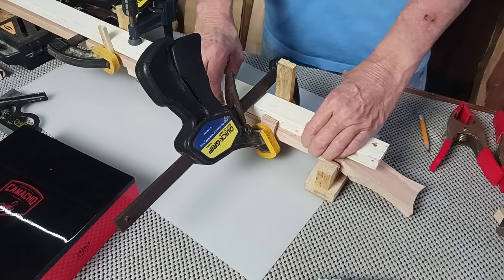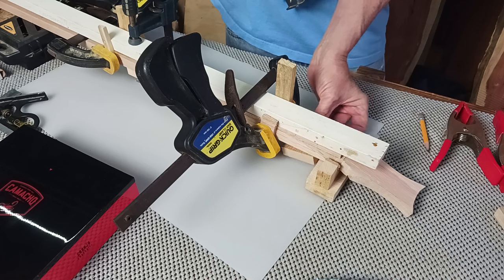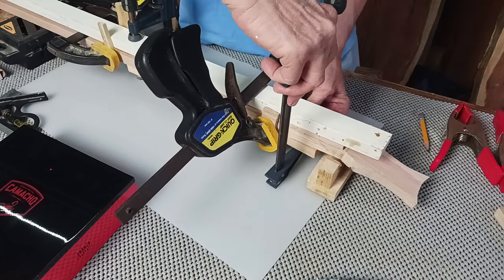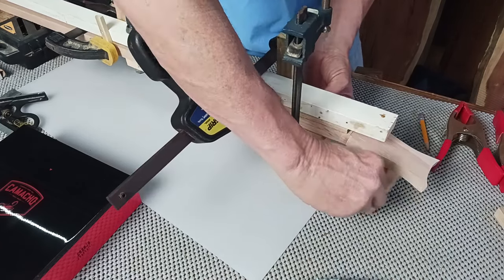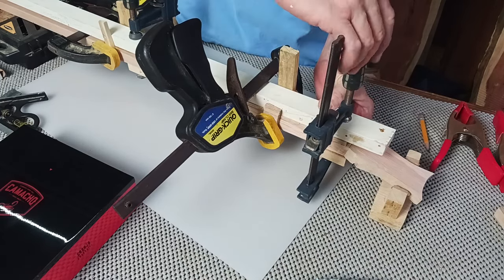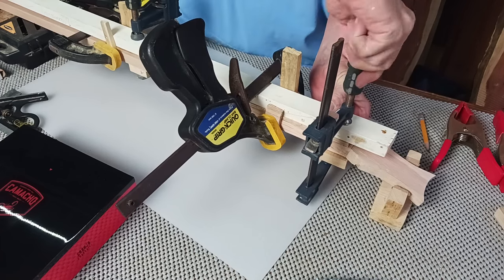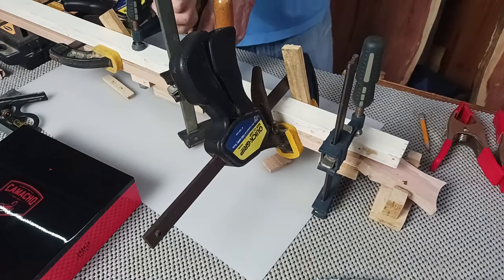So you can see I used a couple of clamps with a couple little pieces of wood to keep the fretboard and the neck even while I put on these other clamps. Everything wants to move when you have this much glue, so really pay attention and just keep checking it. And you might have to loosen your clamps, move it a little bit, and tighten it all back up. That's what you have to do. So now it's in the clamps, we wait. So the next video, we'll cut the neck slot in the box and get the neck fitted.